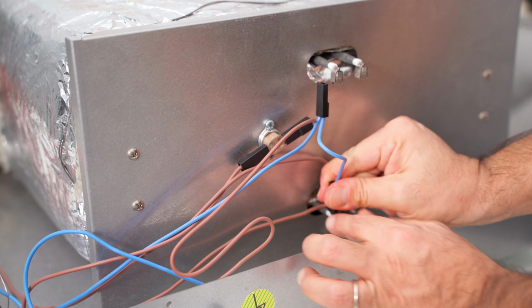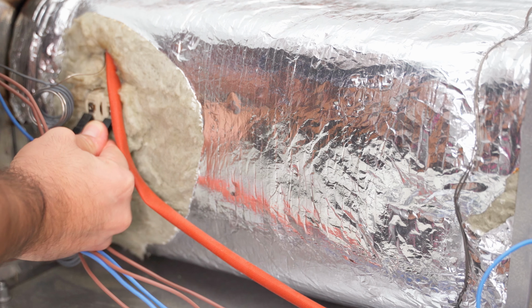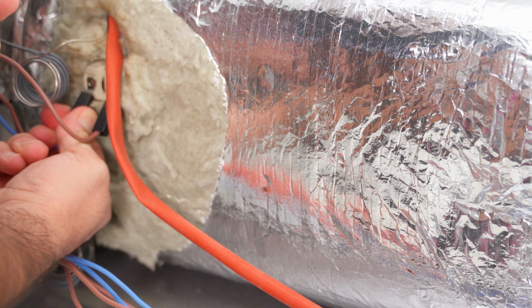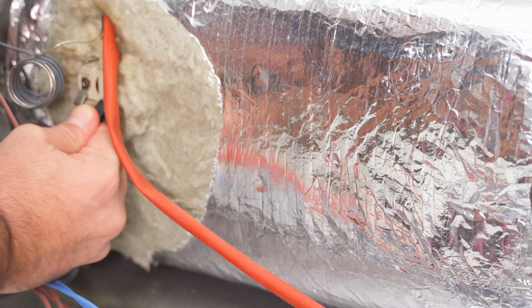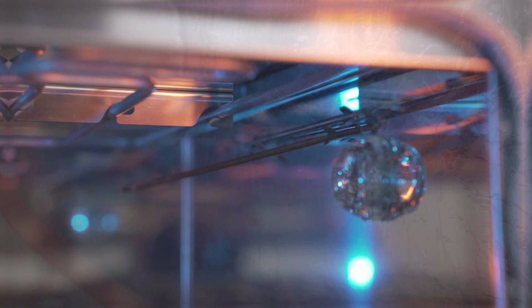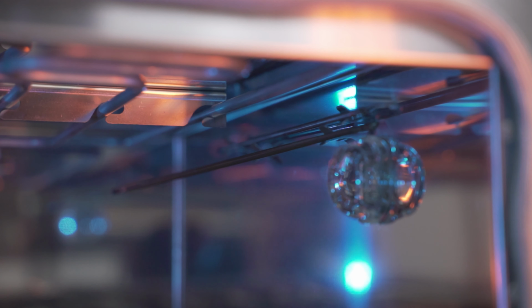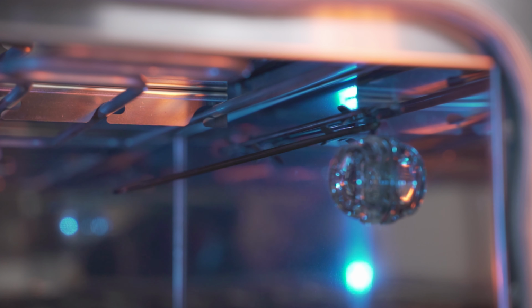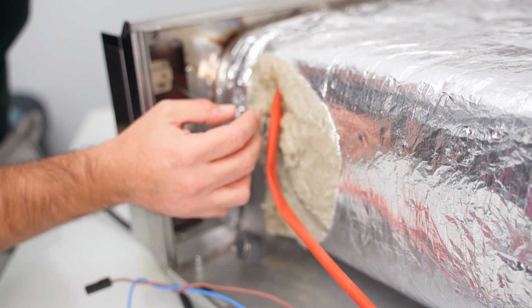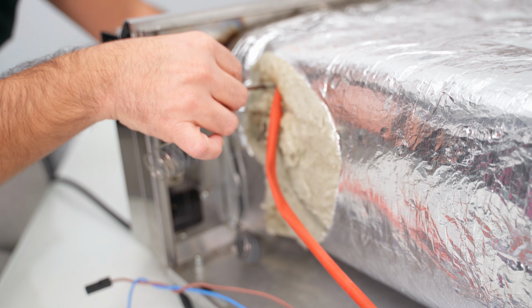Then let's go sideways and also detach the fastons that go to the oven lamp, and we will be doing this slowly because it is a quite delicate area. Then we try to mark these 2 cables because we should reconnect them afterwards. We then remove the 2 probes from the probe stop inside the oven, and we pull them from the outside for removing them completely. As for the upper one, remember you have to remove the first probe at the top, not the one a little bit lower, which is the safety thermostat one, that needs to be kept as is.